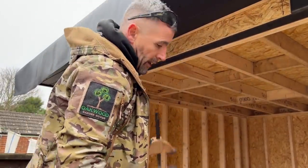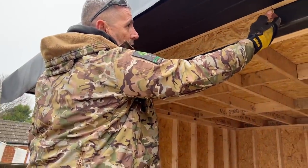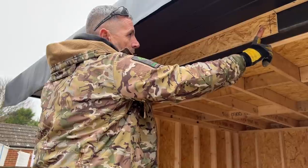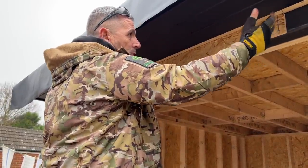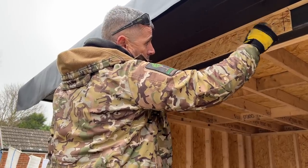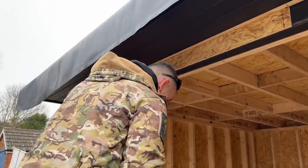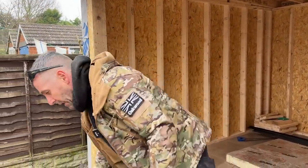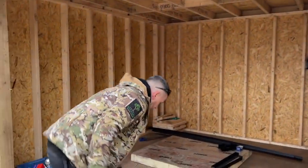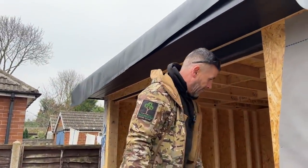Just to hold it in place — the reason being is when I put my slate batten over it that will have increased the depth. I'll have the 25mm slate batten, another 11mm on that which is 36mm, and then I've got another 80mm on that, so that will be fine for the 100mm screw. It will go through and it won't hit the back side of the steel — it'll pull in tight — so I'll be able to get my slate batten on there. I'm just putting two small ones in there just to hold it.